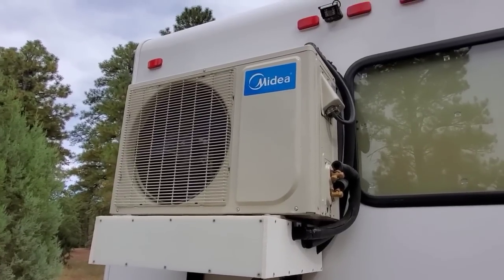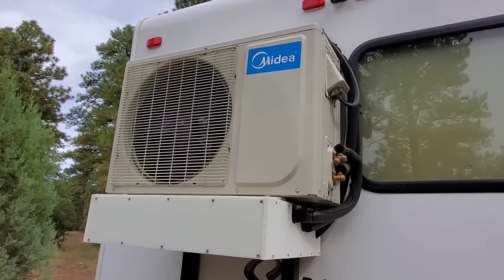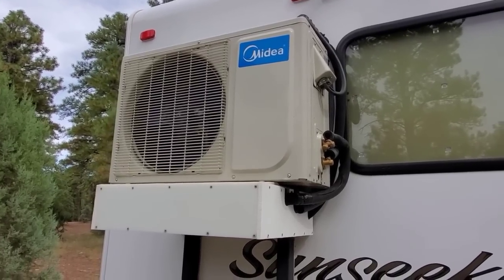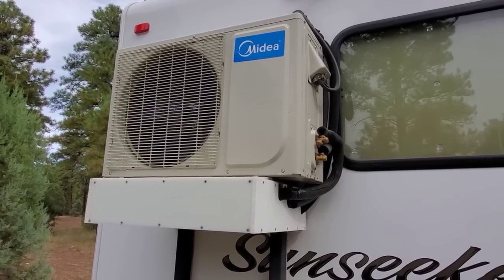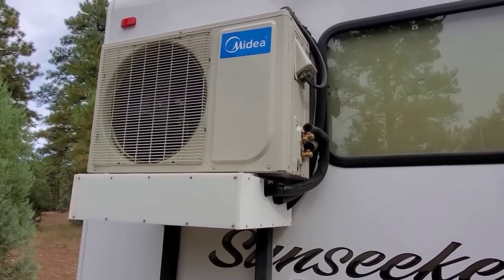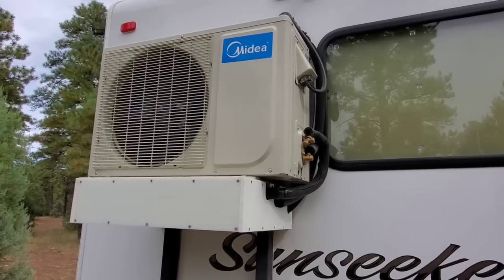So if we were to calculate that out, then the unit in normal mode should use 369 watts and 451 watts in turbo mode, which is 9,000 divided by 24.4 and 11,000 divided by 24.4 respectively. I say should because that is at 100% efficiency. However, with heat and cold losses, along with bearing and seal friction losses, the actual wattage used will be higher.